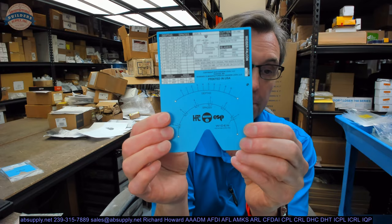The way that the HPC code cards work is that they have an area into which you slide the code card into the machine. You've got an X and Y axis wheel on the machine where you can move the carriage left to right and then set the depth — let's just call it a two-axis style machine.